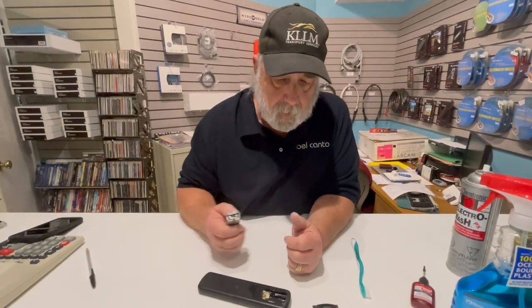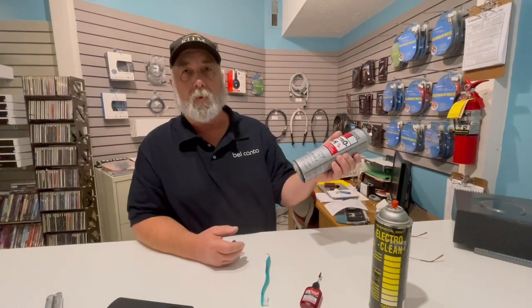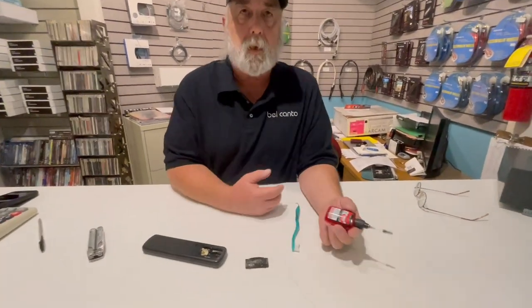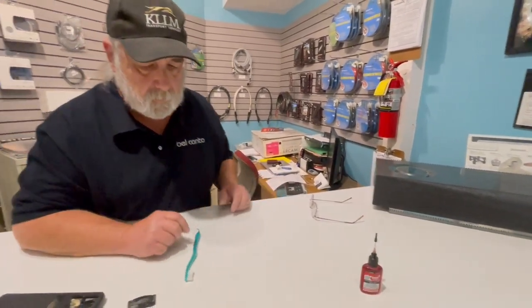More importantly, when they leak they actually do substantial damage to the metal surfaces that are supposed to be part of the contacts. Now the usual temptation is to use some form of liquid — or some form of electro wash — well, good luck, because if you don't melt the plastics you still don't want to use that. And some people try to use DeoxIT straight out — now DeoxIT is a fine product, but at this stage it's the last thing you do.